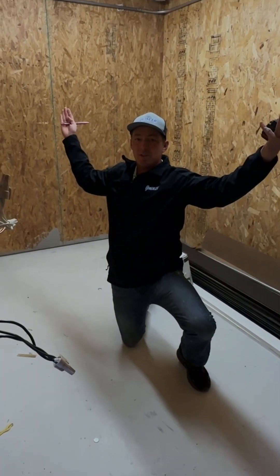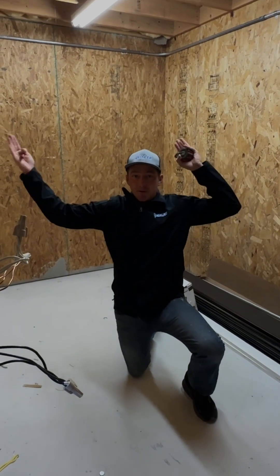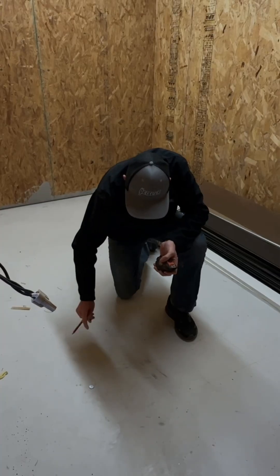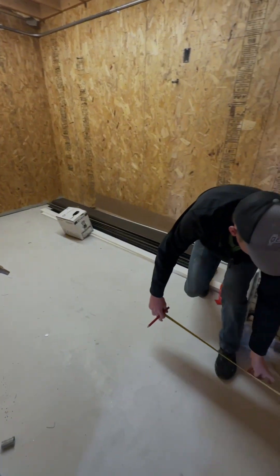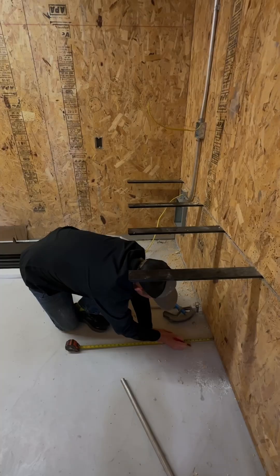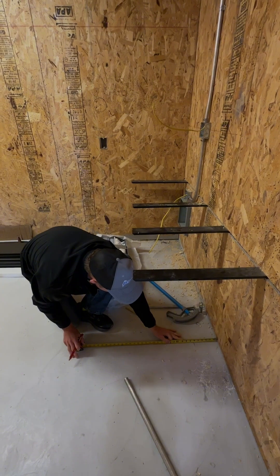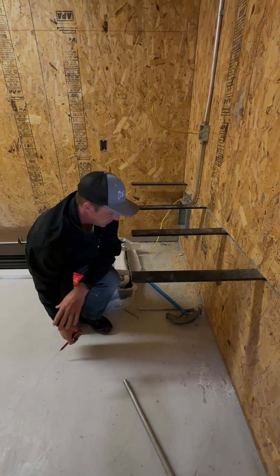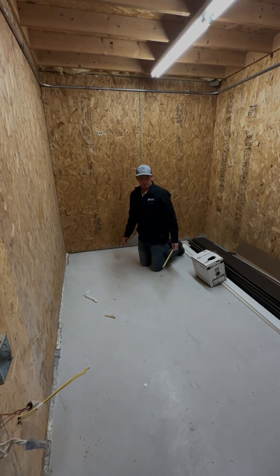In this office there's going to be a cloud ceiling installed with six-inch gaps all the way around, so that's going to reduce everything by 12 inches, giving us 154 and 81. We'll go ahead and mark out that six inches — that's well above average.